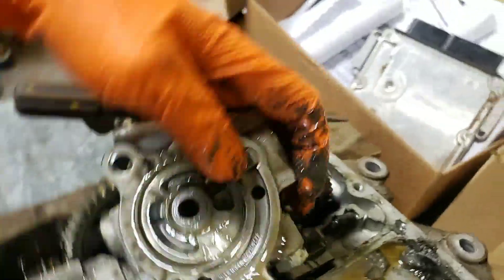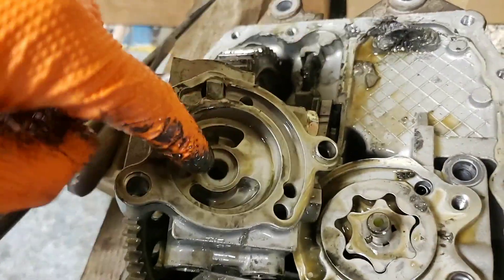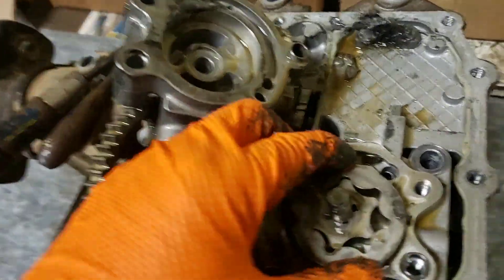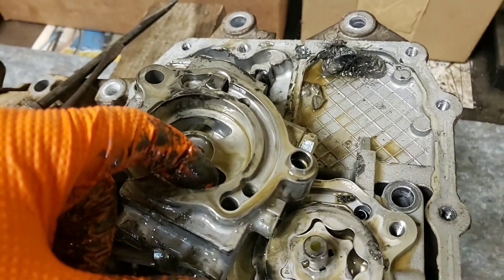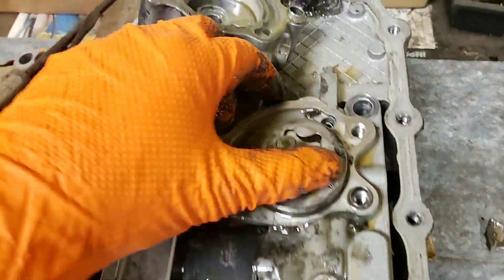This has a little inlet where a filter would sit — that's your suction side. So it actually starts sucking in right here. The suction gets pulled into this port by this pump mechanism, then pressurized oil gets pushed back out this side and goes down into here.